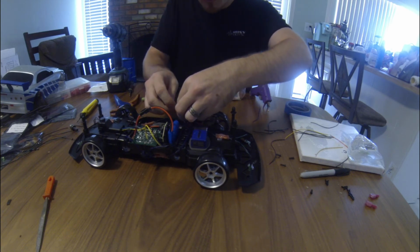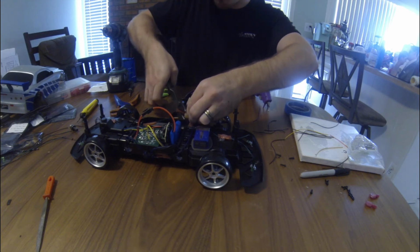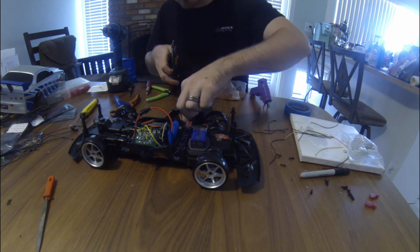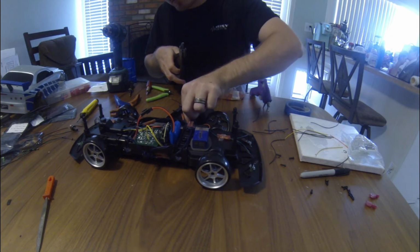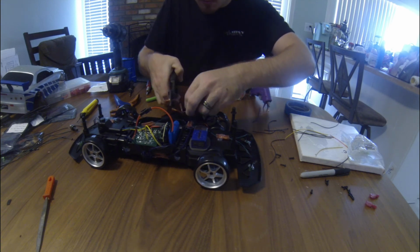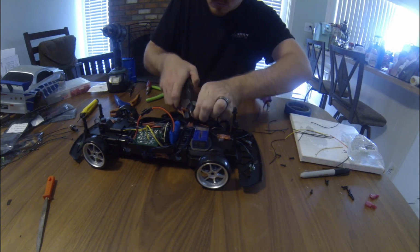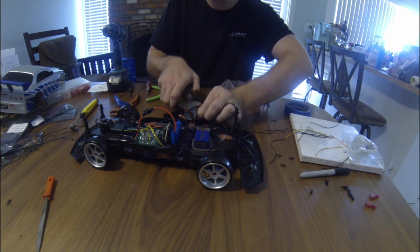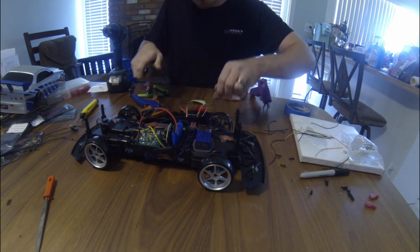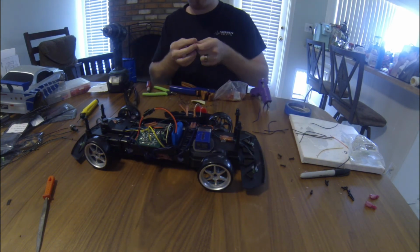When you're linking all the wires inside the shell, the upper shell, it is important that you pass the wires through before you crimp them together, because once they're crimped together, you cannot fit them through there unless you drill a bigger hole, which is up to you. But you do want to link all the negatives together and then use one barrel connector, and then take some excess black wire that you have left over, probably the longer portion, and feed it back out that same hole, so that way you have a pigtail that you can put the spade connector on to attach to the shell.